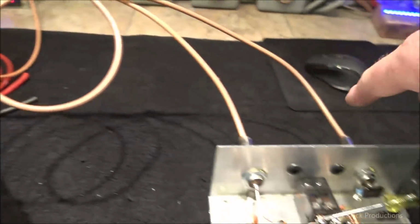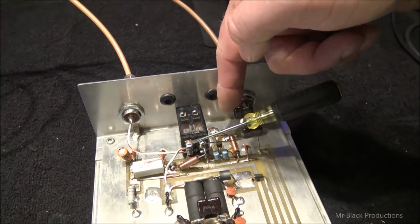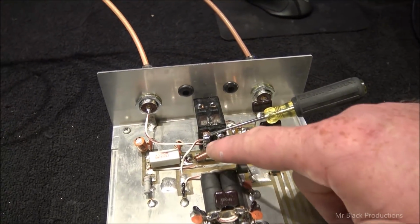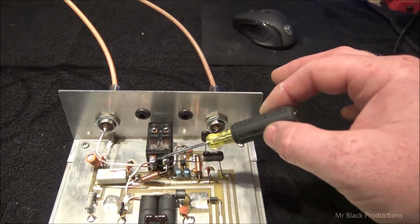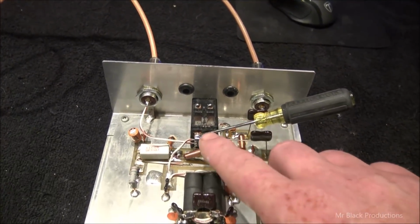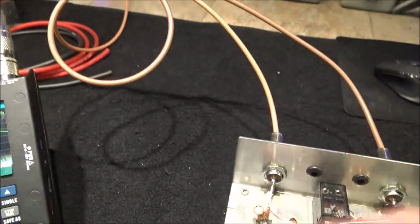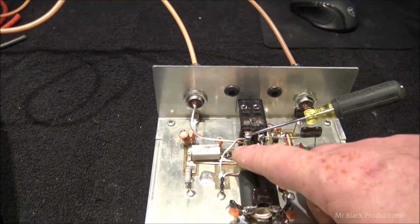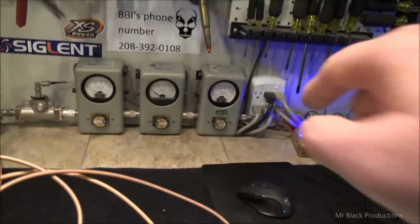It's going through the wire, coming down, going through this blocking capacitor, and it's coming through the blocking capacitor across, through the input of the relay, across the screwdriver. Now watch what happens. Take the screwdriver out of the way, put this back in. Now, we're not paying attention to the induction that this is actually adding. We want to make this loop that goes in and out of this box as low as possible. So RF's going across the connection of the screwdriver, going back down through the body of the relay, across the wire, out and around, and then into the dummy load.